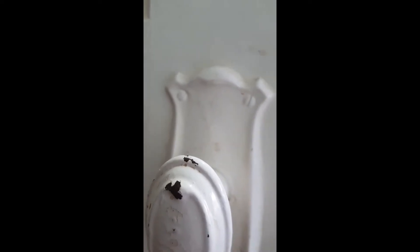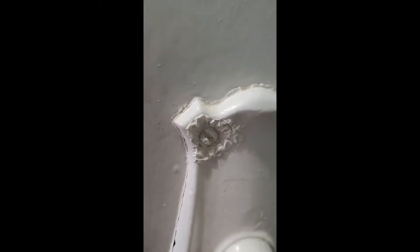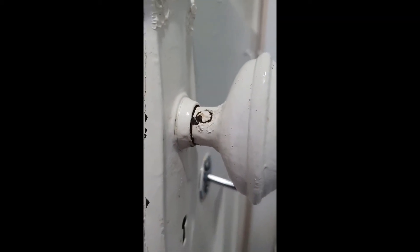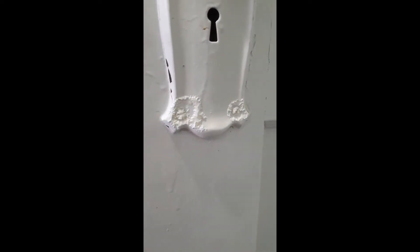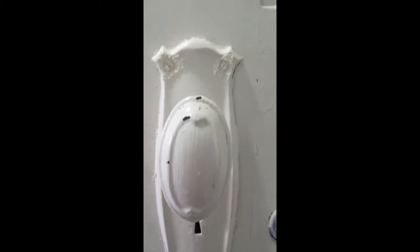First of all, I can't even get to the screws because they've been painted with layers and layers and layers. So I've put some paint stripper just on all those bits that I need to do to be able to remove the door furniture. I'll clean that off — it needs to sit on there for about 15 minutes.